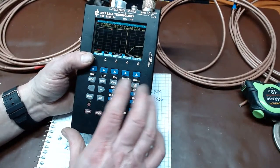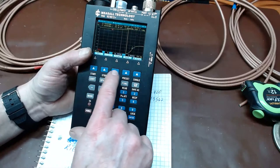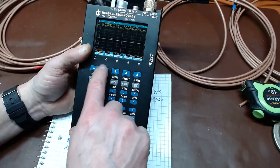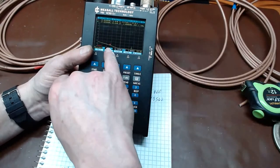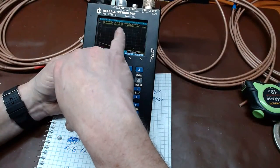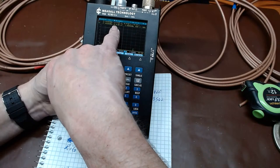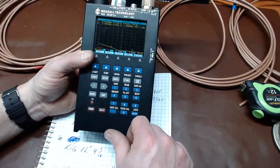All right. Do. Mode. Format. Return loss. All right, so our return loss, and like I said, this is off of a different one. This is off the Rig Expert. The return loss here at the 27402, approximately, is giving us 35.4 dB, which is actually really good as far as based off the coax itself.